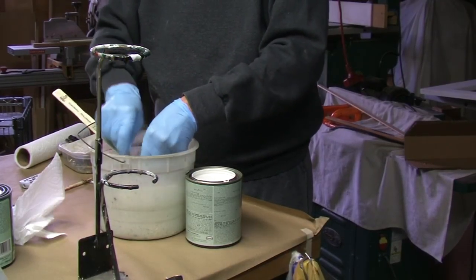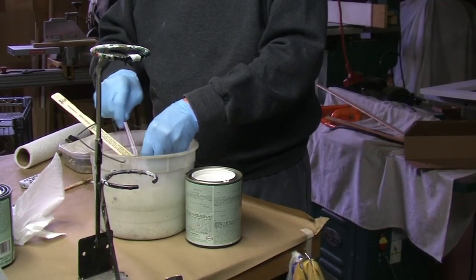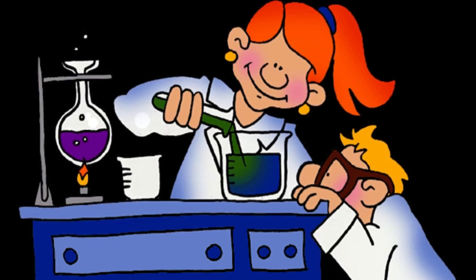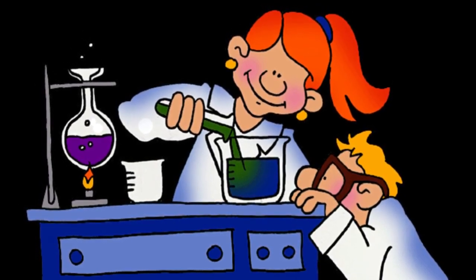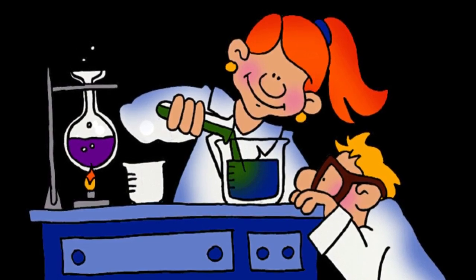Note that I have a small pail of water set aside to immediately clean the cup. Water could change the chemistry of the paint. In my research, I didn't find anywhere where someone said water does change the chemistry, but I'm still dubious about adding too much. When spraying furniture, it may be best to use acrylic enamel, which can be substantially reduced without harming the material's properties. Acrylic enamel is solvent based and should not be sprayed in a confined area where a spark could ignite it.